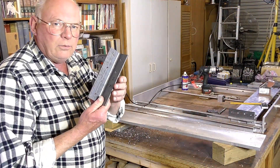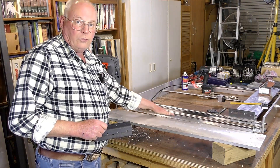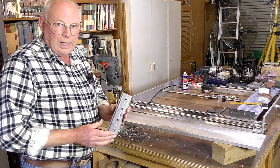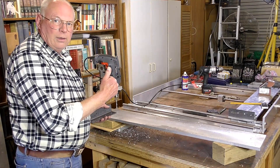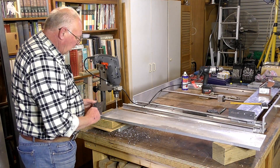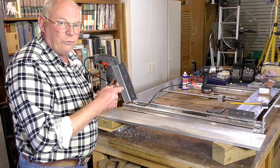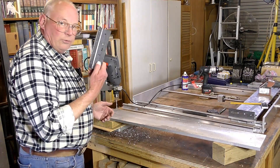These are the brackets that I've made to strengthen up and do the main fixing of the gantry to the side plates. I've used steel in this case, so they're going to have eight fixing points — four go in on to the back of the gantry main structure, like this, which I've now pre-marked. All I did was clamp this to the plate and just mark the holes through these drillings. I'm going to tap a thread in these after I've drilled them so I can fix these plates on.